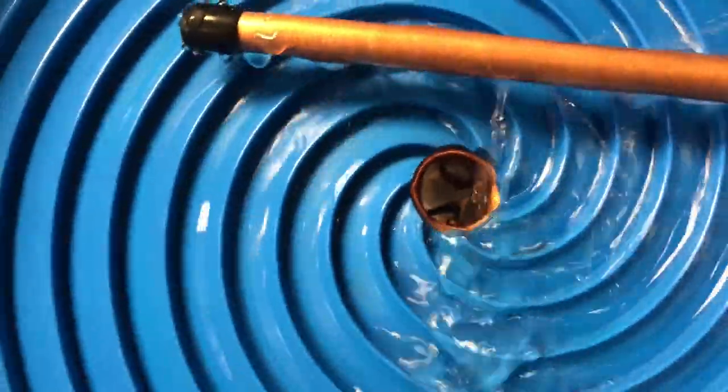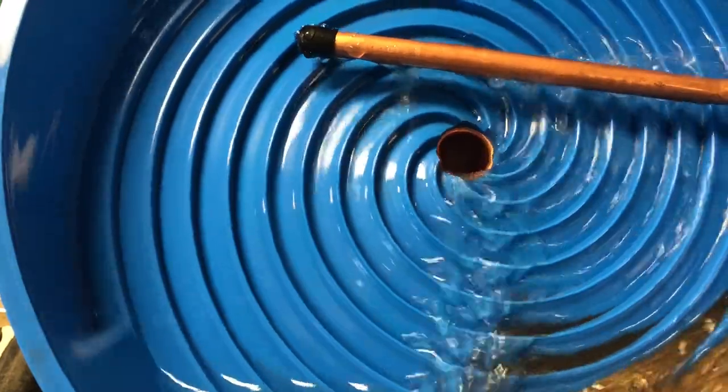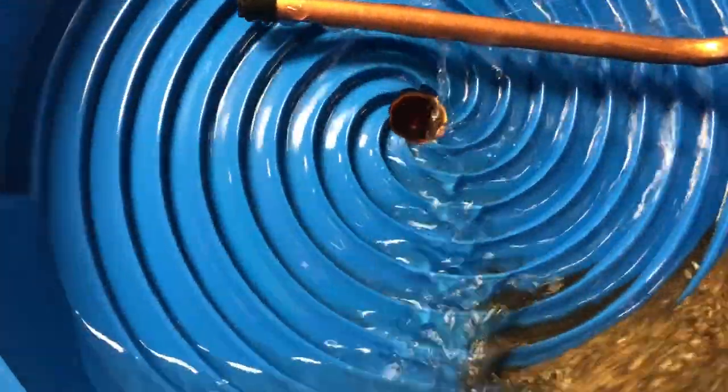Let me zoom in on that. We're talking just a few granules. You can run this where there is no black sand moving up, and a lot of people use that for a clean gold cleanup. My experience though has been that if you want to capture very, very fine gold, you will have to have some black sand going into the drop cut — not a lot, just a little bit.